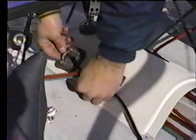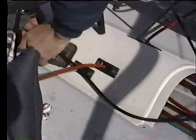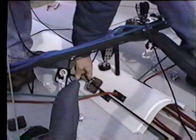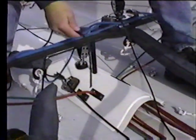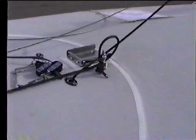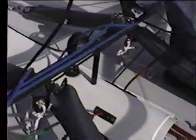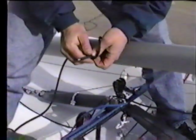That black rope is now going to go back through the cockpit, underneath all the ropes, so it lays as close to the floor as possible. It's going through a cleat with a fair lead and then a pulley back by the center traveler. There's a cleat and then a pulley, and then you're led right back to the skipper. So you've run the spinnaker halyard through the deck to a pulley underneath the deck, along the bottom, and then right back to the skipper's compartment back by the traveler.